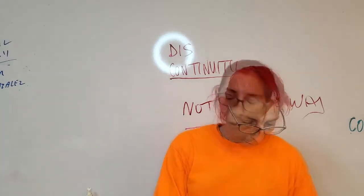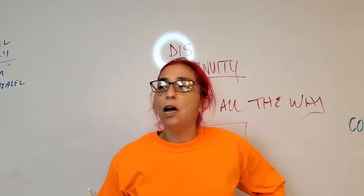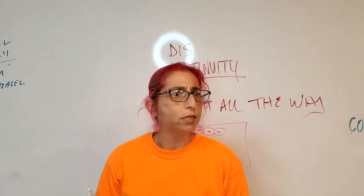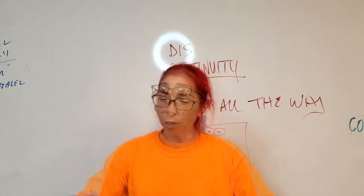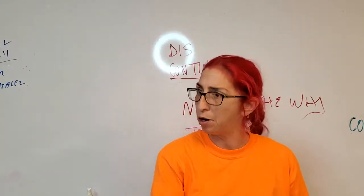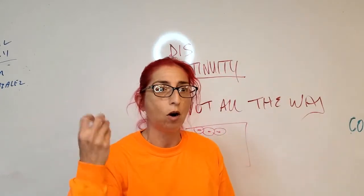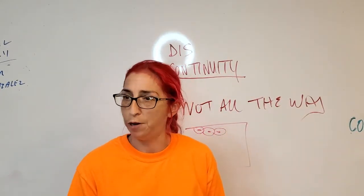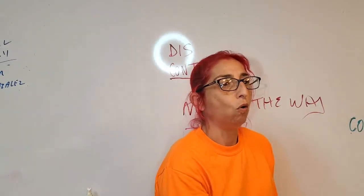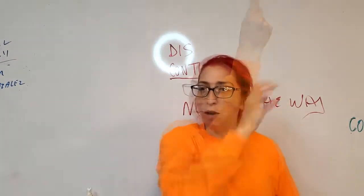Okie dokie, what else we got? Porosity. Ooh, I hate porosity. Why does porosity happen? Well, there are a couple of different reasons. Porosity is little gas bubbles that get stuck in our weld. That's really what it is. It's nitrogen and oxygen trying to exit our weld before it solidifies, and while it's solidifying, it's coming out and leaving little holes. We can even have some that are called wormholes, which travel if you have big bubbles.